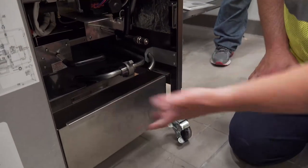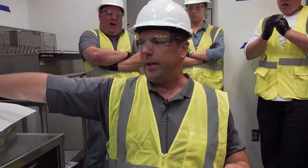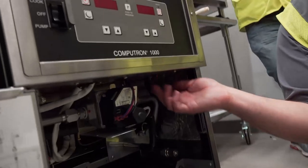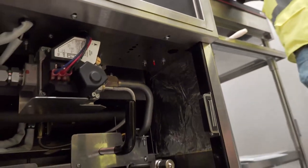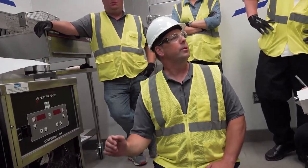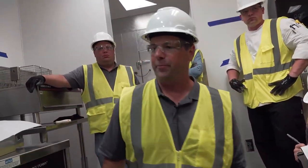There's also a condensation pan. If you turn this on without any oil, or if the oil level gets too low, it has a high-temperature cutout safety feature that will trip a reset. The reset button is a little red push button below the bottom of the fryer above the handle — lift up and you'll feel it. Clicking that will reset the unit to re-fire the burner. If you ever turn this on and it doesn't start up, check if it's out on reset. But if it tripped the reset, there's a reason — check your oil level and investigate what caused it to overheat before resetting.